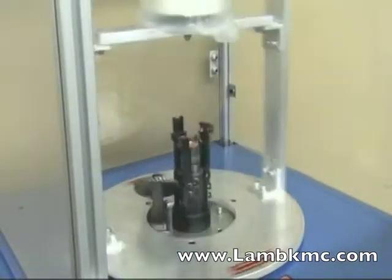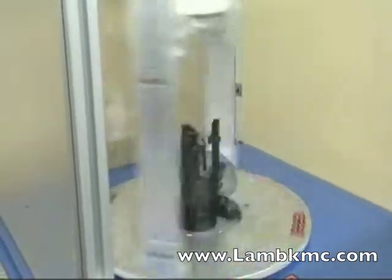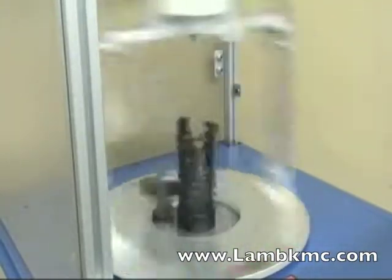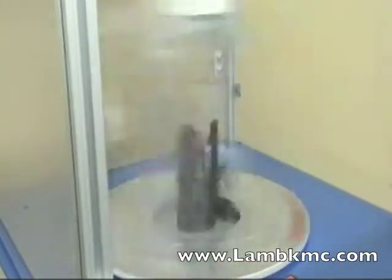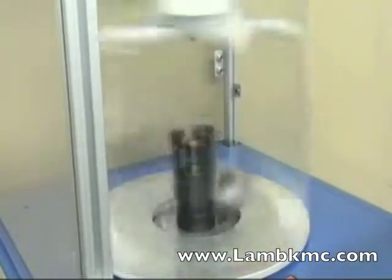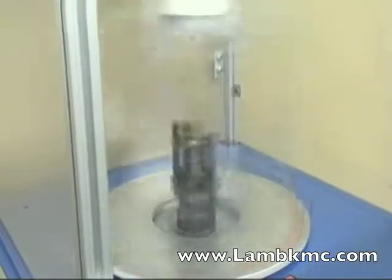The machine is an update of an old concept in knitting, utilizing a pattern wheel to select needles on this circular weft knitting machine. The unit shown is a 1¼-inch diameter machine with approximately 40 needles spaced evenly around the cylinder. Lamb can manufacture this machine up to a 4-inch working diameter with up to 4 feeds, depending on your specifications.